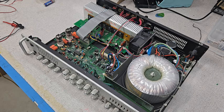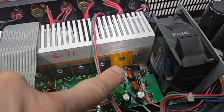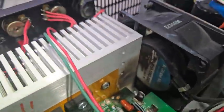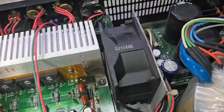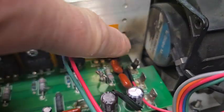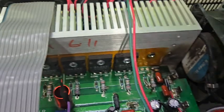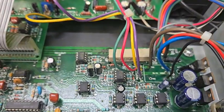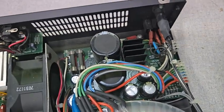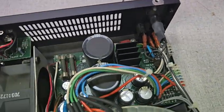I can see something right here — I'm going to freestyle this. There's obviously something that blew up inside, about where I saw some black stuff, and it's on the fan. This looks like the power output section, because those look like output transistors. There's no heat sink compound — they're using some kind of plastic film, which I question as a heat transfer solution. A plastic sheet sounds more like a heat insulator. I've heard rumors of non-original capacitors that had blown out.